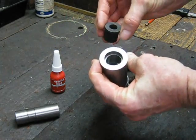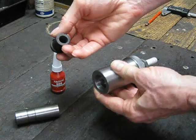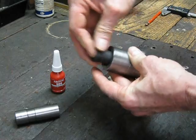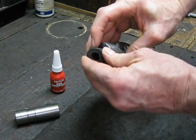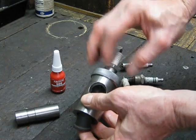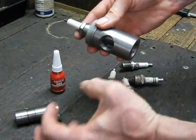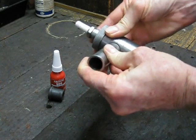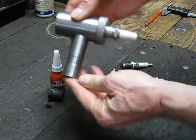On this end of the chamber, this is a shock absorber grommet — the kind that goes around a mounting pin — and I've got plenty of those lying around. That's going to be the seal for the grit gun nozzle, so it will push right in there. I haven't put it in yet because I wanted to show you what the inside looked like. The nozzle for the grit gun will come in through here and it will blast the grit up the chamber into the spark plug end. The grit will then come out this cavity and exit through this hole — this is the escape tube, which fits in there snugly.